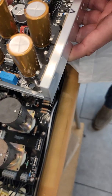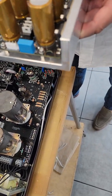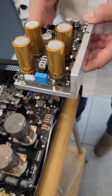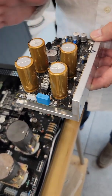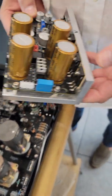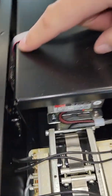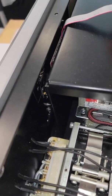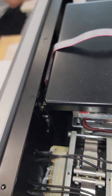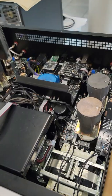In the RS, each power amp has its own power transformer, so they're dual mono, completely separate — no ground loops, nothing that can go wrong. The display system, CPU, and control are identical, connected via this ribbon cable, which is why we don't have to switch it.